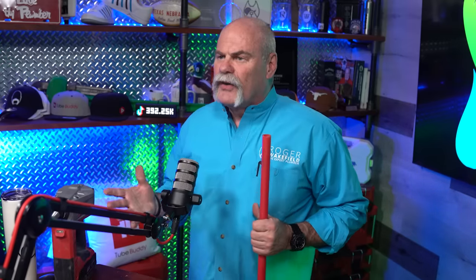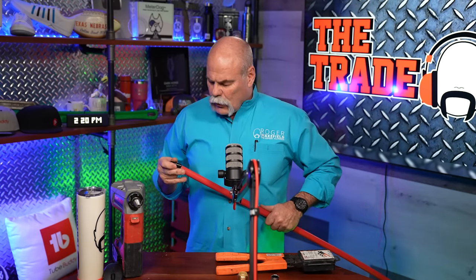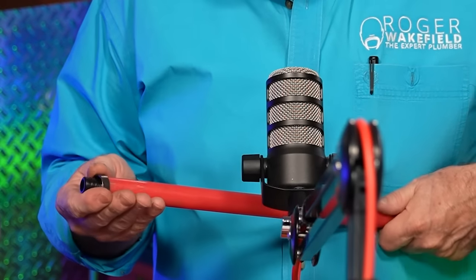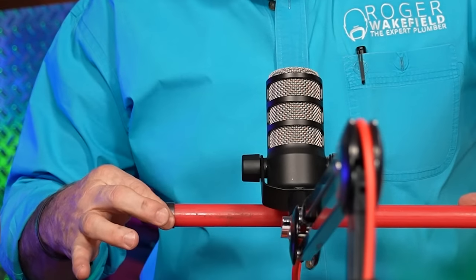PEX-A is really simple. Now, say you're in an area where you do need PEX-B. There are some reasons to use it — I'm not going to say never use it. Just make sure as a homeowner or plumber you know what you've got and where you're installing it. I would never install PEX-B up in an attic where it could possibly get cold. For PEX-B, you're going to need a crimp ring. Go ahead and put your fitting in the pipe — remember the flow restriction I told you about? There it is. Now take the ring and put it over the end, leaving about an eighth of an inch so you can see the pipe and know you're not right up on the neck of the fitting.